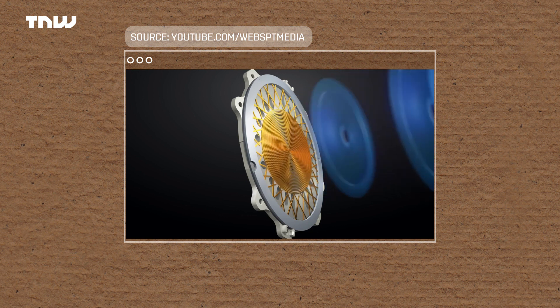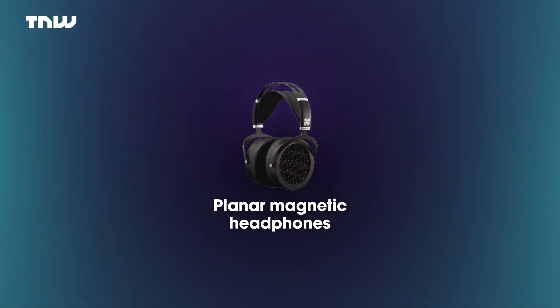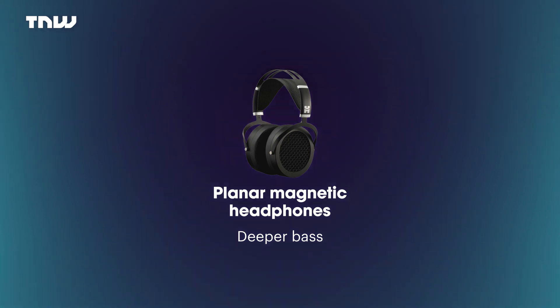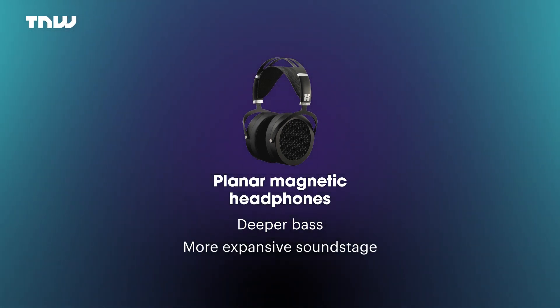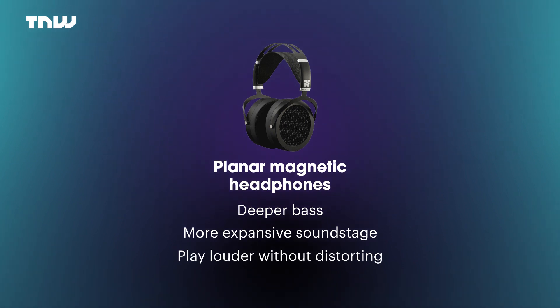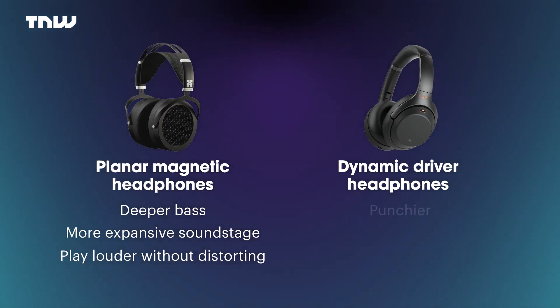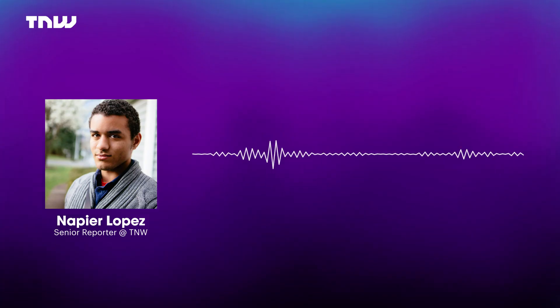Because the force is distributed evenly across the diaphragm, the whole thing moves in unison. So what does that mean in practice? Planar magnetic diaphragms are typically larger than their dynamic counterparts, which can lead to deeper bass, especially in an open-back design. They also create a flat sound wave that arguably creates a bigger soundstage, and that even movement helps them play louder without audibly distorting. On the other hand, dynamic drivers are often punchier, and the headphones tend to be lighter and smaller. Ultimately, these are just generalizations — implementation matters much more than the specific technology.